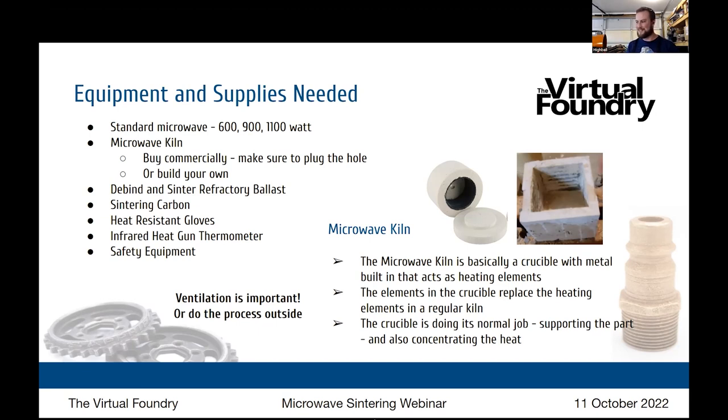That aluminum just about a month ago was sort of like off the table for me, and probably a lot of people, at least sintering, since the only current process that I'm aware of for additive is a laser sintering. I'm not certain that there's any other filament based method for doing that. And you have to sinter in probably a hydrogen reducing atmosphere, which is also unattainable for somebody in the shop.